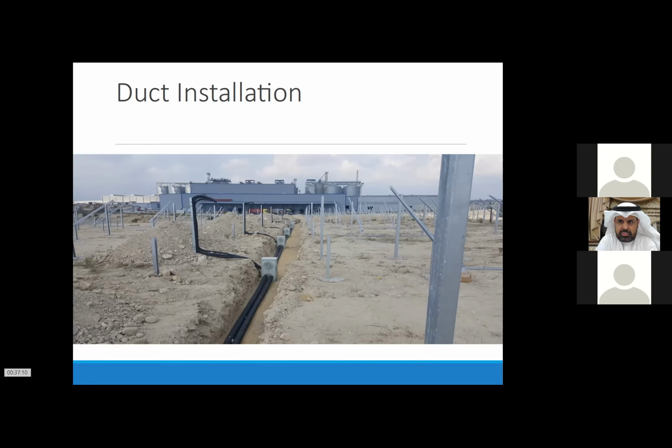Well, like you said, if you have an existing ground rod that is nearby, in an existing electrical system, it's always better to have one grounding. Maybe the manufacturer is thinking about lightning protection, maybe there are some SPDs inside. But the lightning protection is separate. We have one ground. Like you said, you have an existing ground rod, so it's always better to use it.